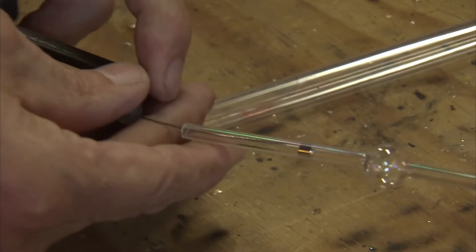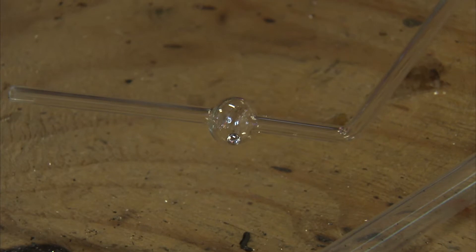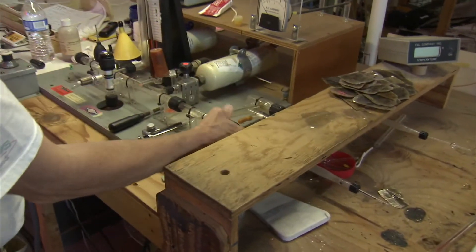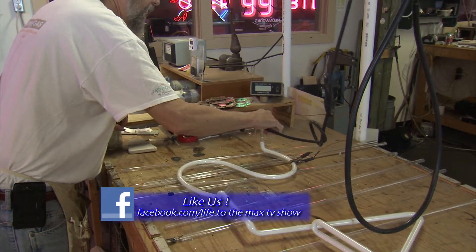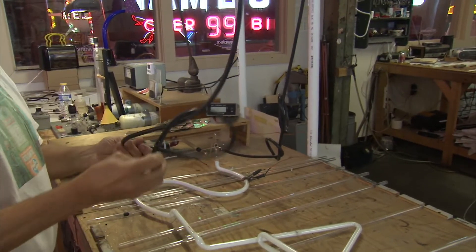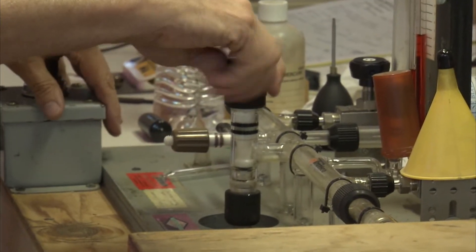The purpose of this mercury is that after I finish this process, the mercury will be dropped into that tube, and the heat generated from the electrodes will cause that mercury to vaporize. When it vaporizes, that will brighten up the tube. I'm hooked up to my manifold here with a compression fitting, and I'm going to open up my valve to my vacuum pump. In a neon sign or a sign that has argon in it, the tubes run maybe 100 to 110 degrees — you can touch them and they're not hot. We're going to put air inside this tube, and when air gets electrical current going through it, it gets really hot, and we're going to use that heat to burn off impurities.